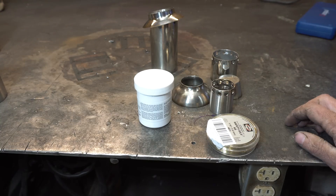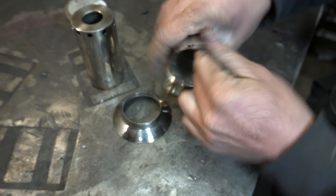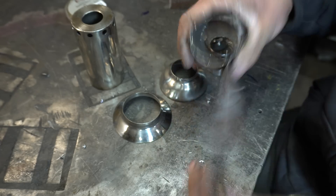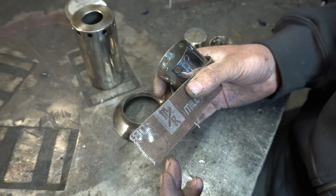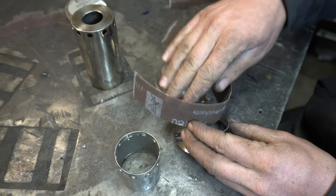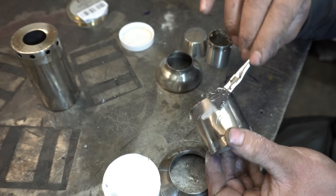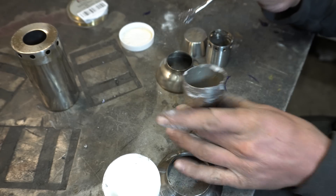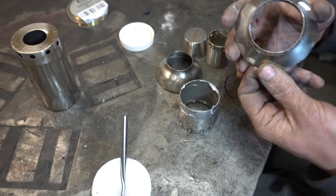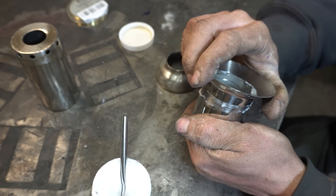I'm going to braze these parts together. Brazing these parts together, I'm going to have to be very careful to keep them all concentric. I don't know if you remember that last stack I built — it was anything but concentric. I have an idea to keep the stack itself concentric, but no idea how I'm going to get the cones on there properly. So I'm just going to fit these parts as close as I can using my laser eyeballs and then throw the part in the lathe and use that to fix any amount of slop that we end up with.